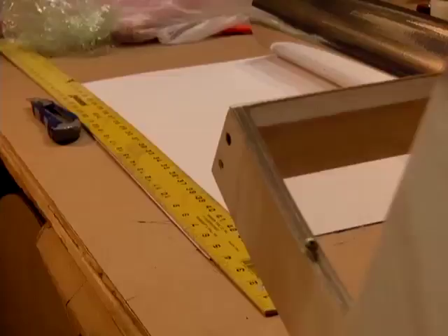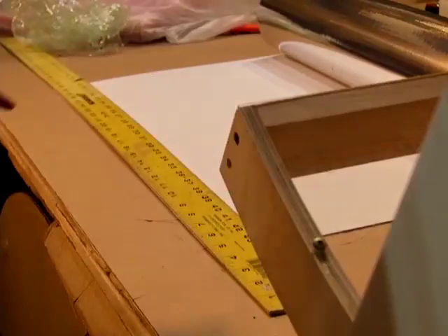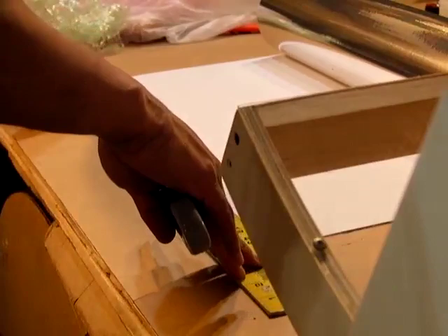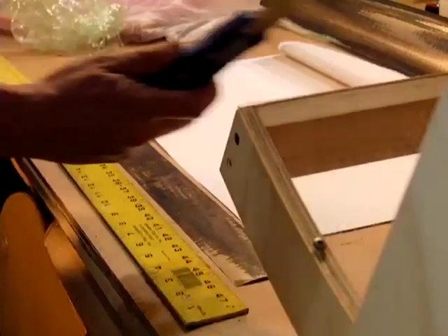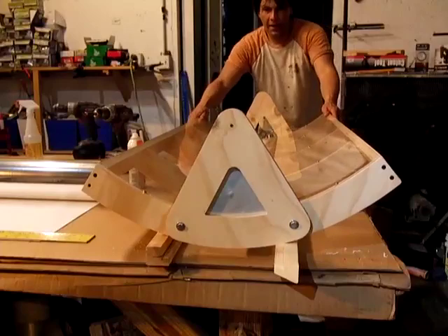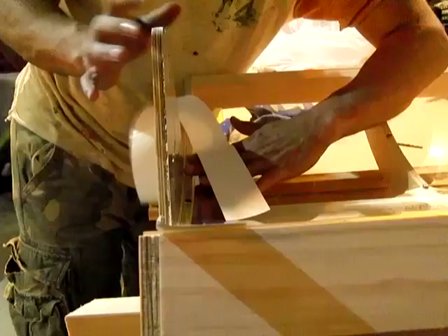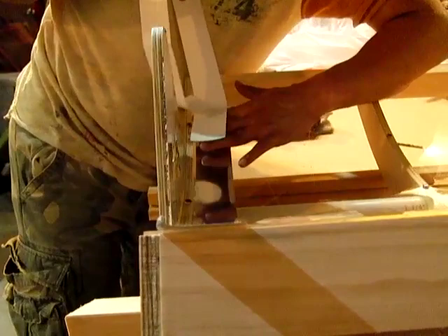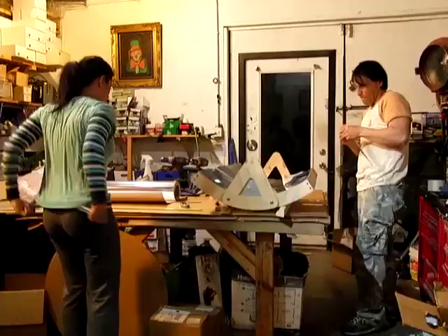This is our part A mirror film. What you do is start with a nice straight edge and use your ruler for the width. Two-inch pieces, which is the perfect width of your standard metal ruler, work perfectly. If you go wider you tend to get a little more bubbles; narrower just takes forever. I'm cutting on a cardboard surface — that prevents your blade from dulling. A lot of people cut on hard surfaces and end up snapping tons of blades off. This gives a more sturdy surface to work on.